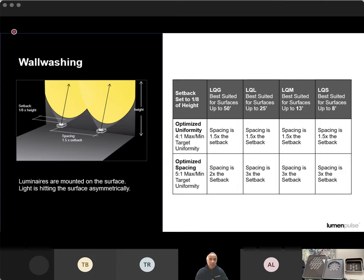For wall washing — most of us know there are a lot of different ways to light up a wall. You can flood it, you can graze it, you can use a type B angle for contrast, and of course wall wash. We've got all the different tools in the toolbox for your wall wash options. It's going to depend on your requirements, how big the wall is, what your spacing is, and what your setback limitations are. We've got the right fixture for each application — small, medium, large, and grande. That's why we have the family of products, so you're not stuck to just one fixture size. Reach out to Lighting Systems or to me if you have questions on spacing setbacks for wall wash optics — we can provide IES files and help you dial those in.